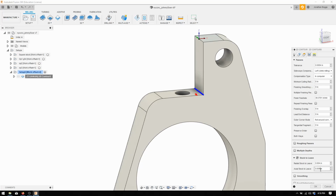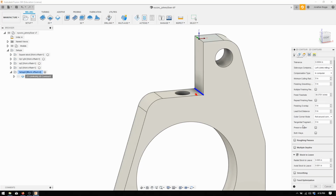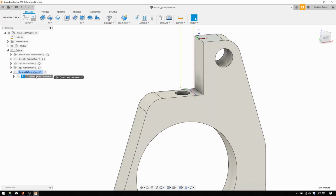We're going to say 0.1 on that, and we'll say 0.5 on that, because what's going to happen is, since we just changed the distance and I cleaned the collet nut out, you might have changed the runout on the actual end mill, and we don't want to have a blend issue, because this part's already finished. Actually, we're just trying to clean up that inner radius, and I would hate for the tooling marks to show up. Sweet. Alright, that's done.